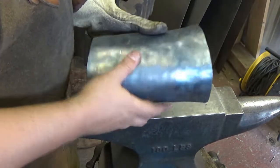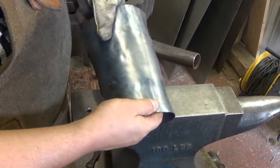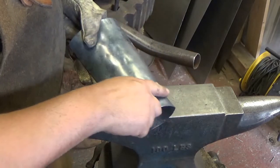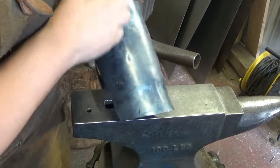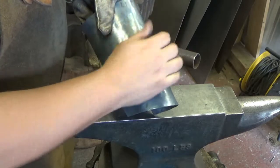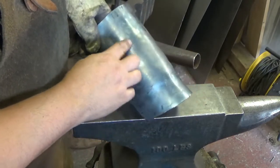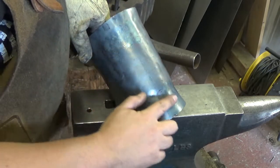So it's cooled down now, we can take a look at where we're at. We've got our basic shape in here. You can start to see how we've got a dip here just about, and a dip there for that lame to go into, and this one for the spaulder to sit onto. Where we push that up to begin with, it's beginning to give us our rough shape with the dip and the slight curvature there in the dip.